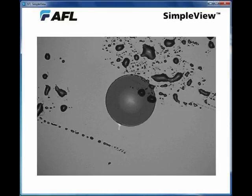All we did was take that nice clean connector and touch it to our fingertip. Your skin is covered with oils, and those oils are generally pretty dirty. They bead up on the end of the connector, as you can see here, and often you'll even see small specks of skin. The warning, of course, is don't touch the ends of those connectors. But if you do, be sure to clean them thoroughly afterwards.